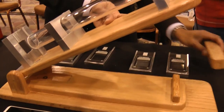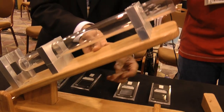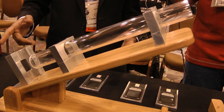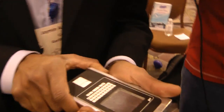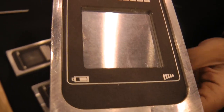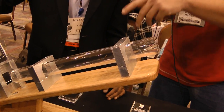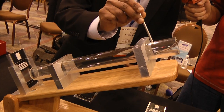What we'll now do is raise this platform from 10 degrees to 30 degrees — so that's raising it by a factor of 3, and as we do that we increase the impact energy at the point of contact by a factor of 3 as well. Just to show you how much impact energy we have, this is a piece of aluminum at 0.7 millimeters — this is actual metal that we're going to drop the ball on.